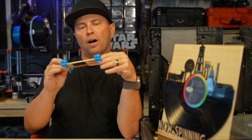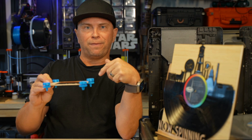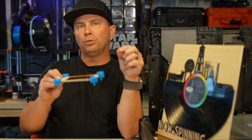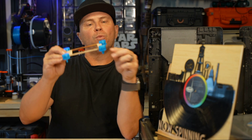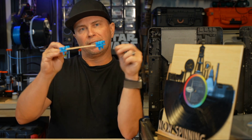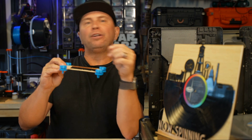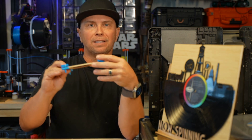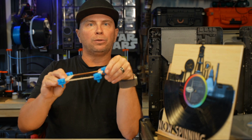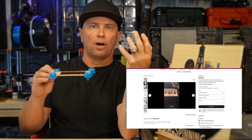Now, these standoffs — you can 3D print them yourself. You can buy a 3D printer for 200 bucks now and you can grab the file. These standoffs do take a little bit more time, but they're invaluable because once they lock into your breadcrumb tray's little clips, you can take a warped piece of board and change that over. This product also exists ready-made — you can buy it on Wish, on Etsy, and at different places. Just look for standoffs, laser standoffs.